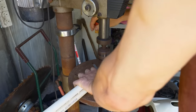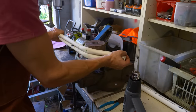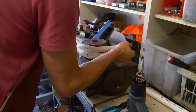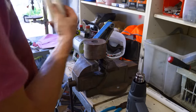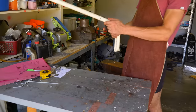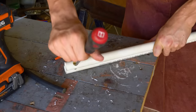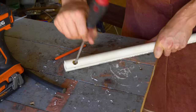Then I just drilled a couple of holes and put the trigger mechanism in between the pipes, and then bent the handle to shape on this cutoff from my giant Beyblade. With regular spearguns, they always have a really small, sharp butt which cuts open your chest if you don't have a wetsuit designed for spearfishing — almost as if the companies are forcing you to buy a more expensive wetsuit. So with mine, I'm hoping that my handle will be large enough and slightly flexible so this won't happen. Now I just need to make a hole for the spear rubber, and just like when you use a rubber, we need to make sure that the surface is nice and smooth, removing sharp bits that would break the rubber, resulting in an unwanted misfire. So I used a file to smoothen the hole of my pipe.